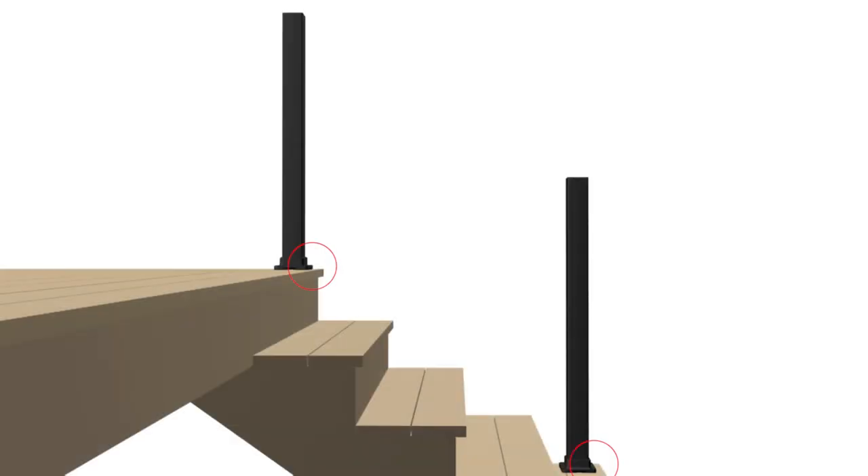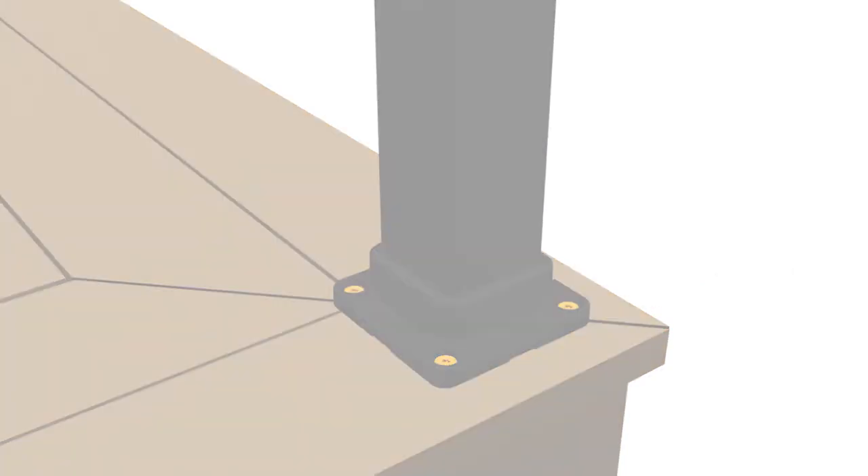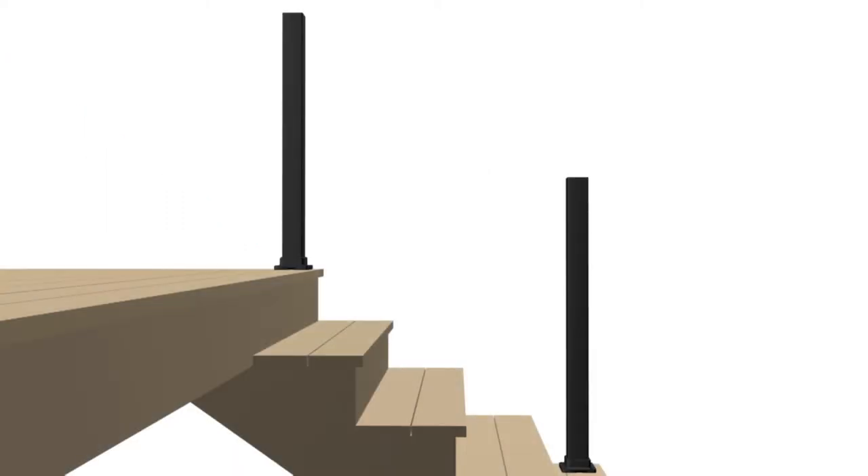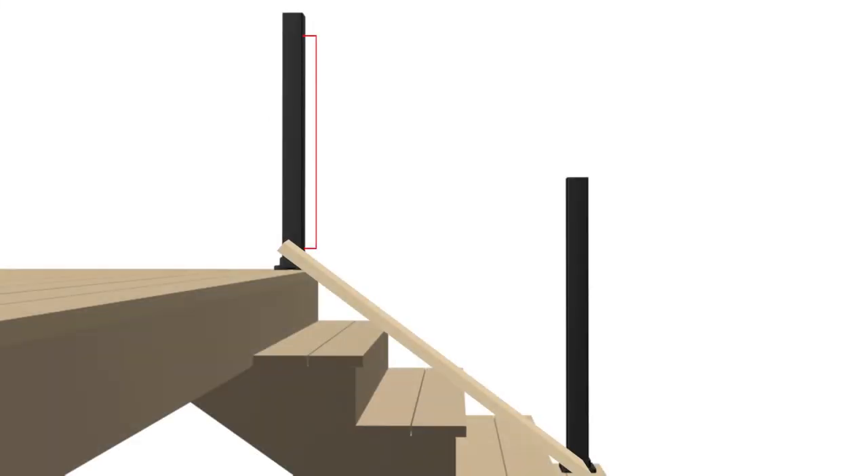Important: The front edge of the base plate should be equal distance from the nose of stairs, but no further than 1 and 1/2 inch setback. Ensure cable holes align with the up-down direction of stairs. For 36-inch stair railings, measure down from the top edge of the top post and place a horizontal pencil mark at 3 and 5/8 inches. Next, measure the center of the 3-inch post and place a vertical mark at the center. Place a 2x4 board on the nose of stairs between posts, then measure the distance between the 2x4 board and the horizontal pencil mark on the inside of the top post. Note that measurement. At the bottom post, measure from the 2x4 the same distance and place a horizontal pencil mark on the inside of the bottom post.